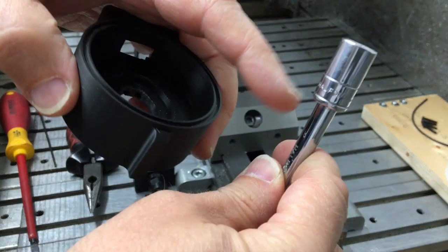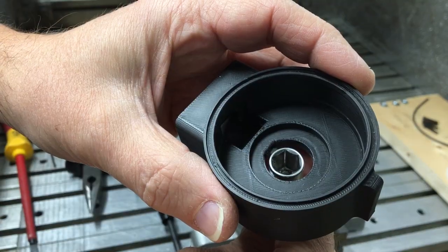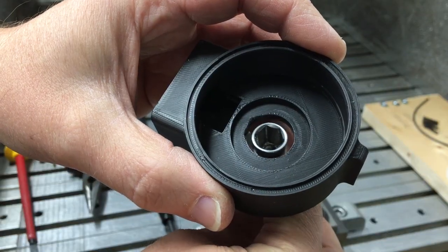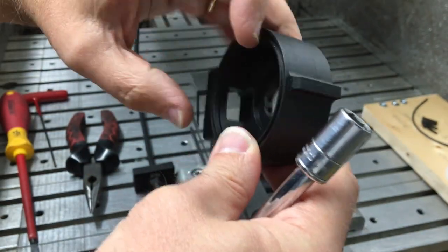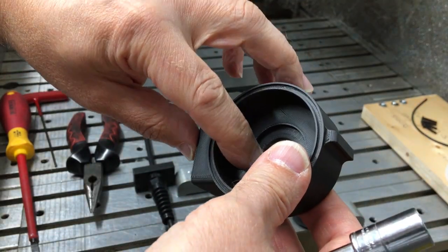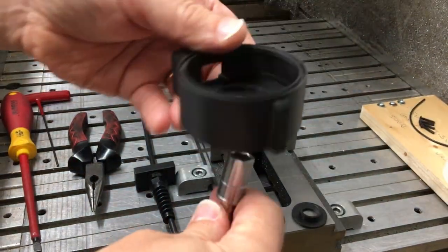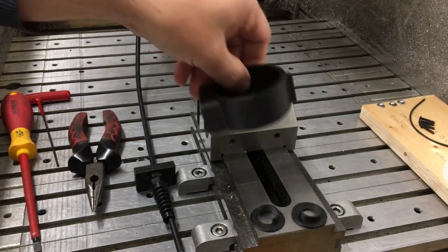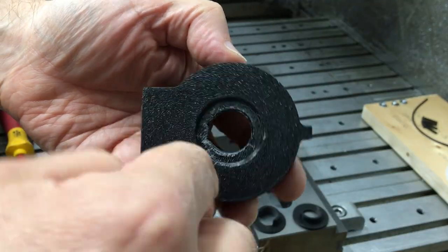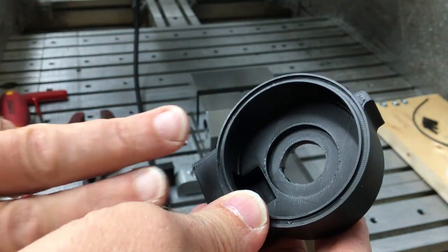I was able to test it by getting a chrome bar that's basically similar to the diameter of the spindle and then just putting it in there and moving it around. Basically if you were at the far side it was okay, but as soon as you got into the middle it stopped working. So it was something to do with the distance and maybe how far back the LEDs were, because when you push the circuit board in they kind of sit a bit randomly depending on how the legs bend. So with a bit of experimentation I ended up printing another one which is in the spindle now, and basically this hole is a lot larger, probably another 2-3mm on the diameter, and that meant the LEDs were effectively much closer to that.